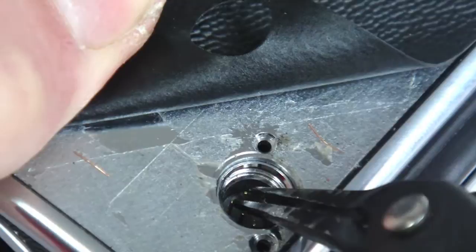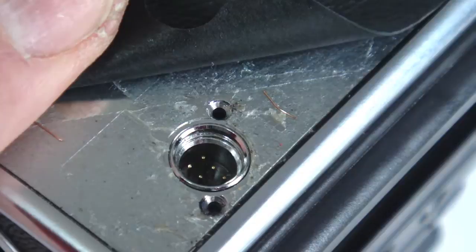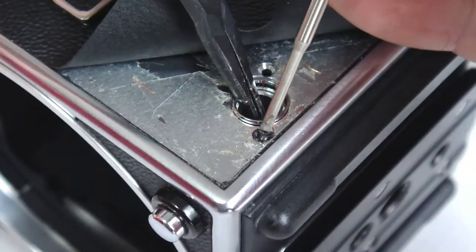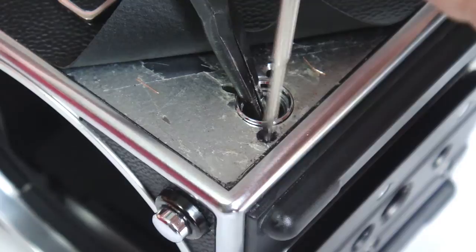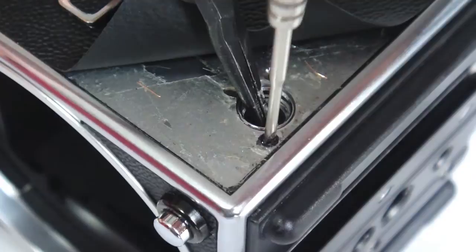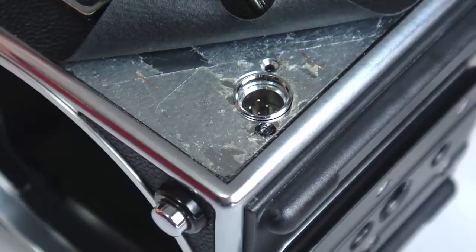The next step on the 503 is a little tricky. Using a small pair of needle nose pliers, carefully grasp one of the pins and maneuver the socket into position. With the screw holes aligned, gently but firmly maintain the position of the socket while placing the screws. With light pressure, spin the screws until the threads grab and begin to pull the socket into place. Once the threads begin to pull the socket up into position, stop before it is completely tight. With a dental pick or some other suitable probe, align the remaining hole as you tighten up the screw. This will snug up the position of the socket and keep the hole aligned for the other screw to be placed in position.